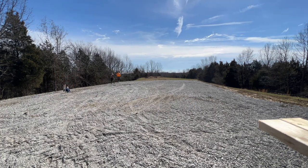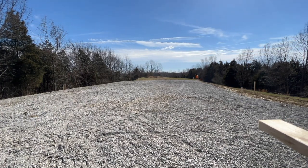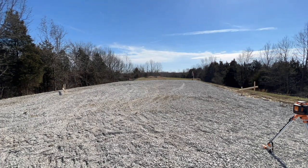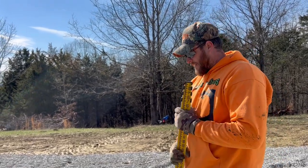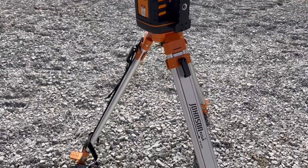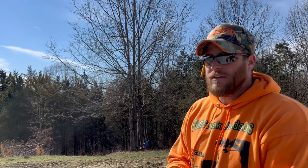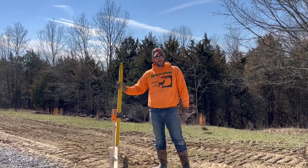Right here I am actually placing some batter boards. I'm using some oak stakes and driving them into the ground, and then I have a pine board that I'm using as my batter boards. Once those are up, we're going to run strings across those and get our square measurements. I have a rough estimate of where the corners of the barn are going to be, and that's how I know where to place my batter boards. This is a Johnson transit laser level that I bought off Amazon — we'll put the link in the description — and this is an awesome level. We leveled out these boards so we can stretch our string lines across to have a good level string.